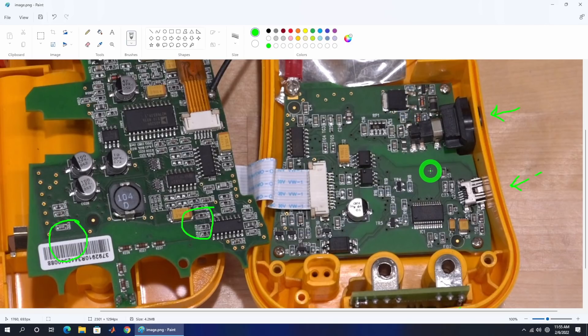I spent some time reverse engineering this, figuring out why that corner of the connector was particularly important for the keyboard. There's an FTDI chip here, and it uses two opto-isolators — you can see they're in opposite directions — to provide communication to the board. That seems covered by most of the connector area. It's just the first couple of pins that appear connected to the keyboard, which is a little strange given how many buttons there are.